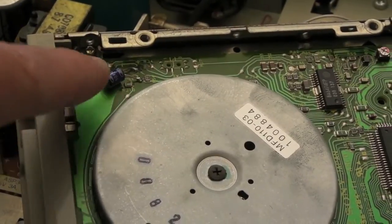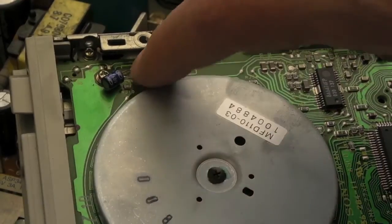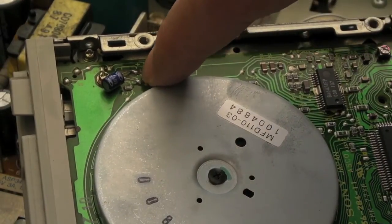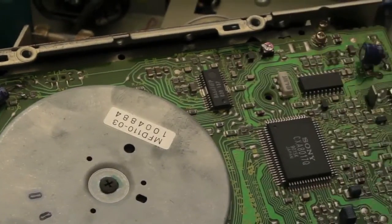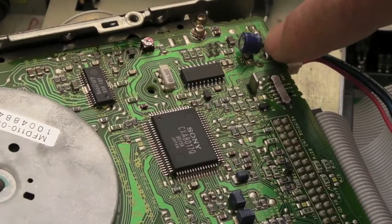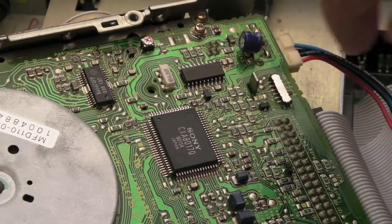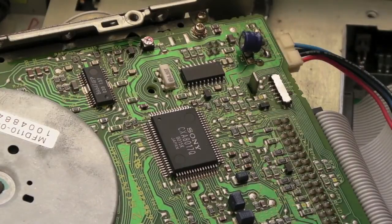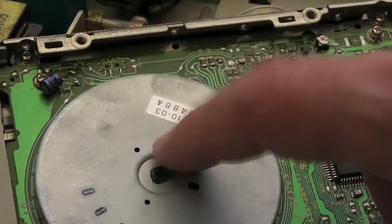There was no easy way to mount these - the smallest electrolytics I could get are wet type. Originally where this was mounted there would have been a little SMD electrolytic. And the same - there was this little SMD electrolytic there, probably on the 12V supply input, it could be the 5V. But in any case, that first cap I showed you is what causes the problems in these Sony drives.